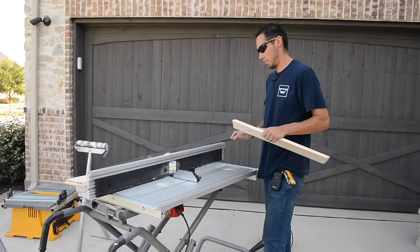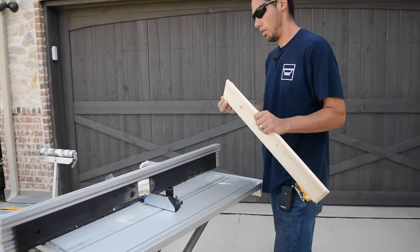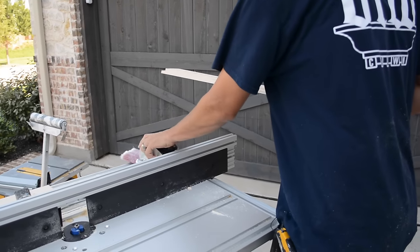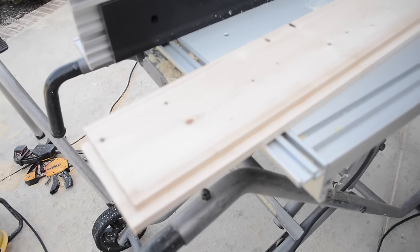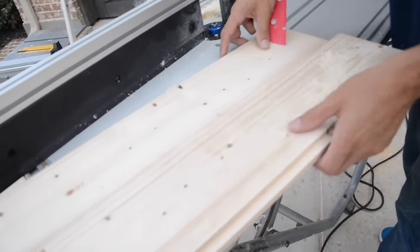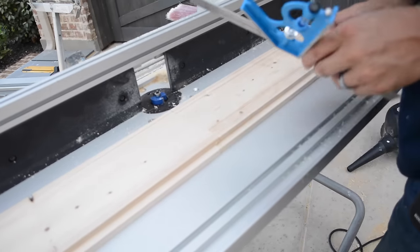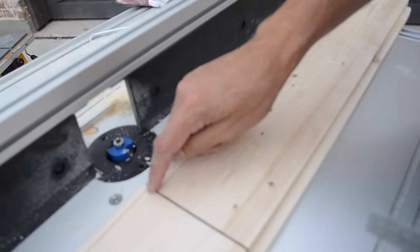It's going to knock down some of those fibers — I'll usually wear a respirator or dust mask, but for the sake of the audio in the video I don't wear it while showing you this. Here's what you should end up with overall: these boards should link like this, being flush end-to-end, and the same thing from side to side — flush that way too. When we put these on the wall we'll space them the same way and still have the wood showing through in the back.